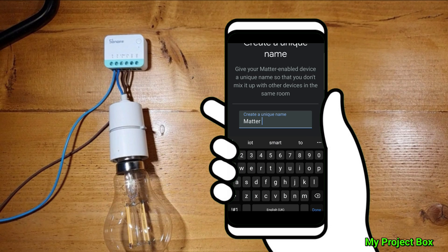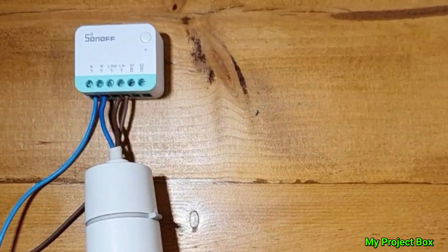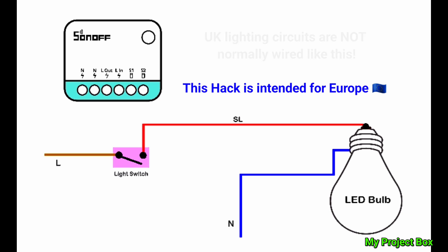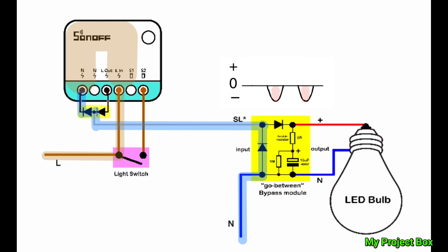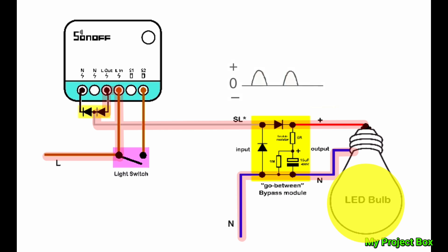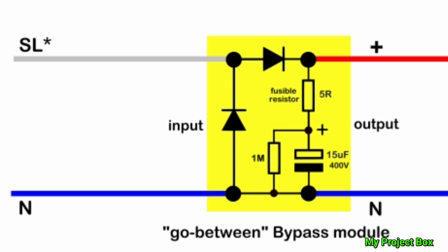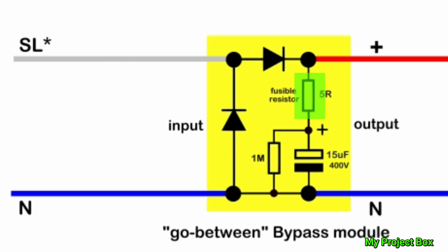Local control without any cloud service, and it works. Now this device requires a neutral connection to power itself, so wiring it to a lighting circuit with no neutral behind the switch is problematic. But if we connect up my special circuit hack, we can divert the neutral back from the light bulb to the Sonoff. This allows it to be powered normally, while still being able to turn the light bulb on and off. The switch line now does double duty — it supplies both the neutral to power the Sonoff and the live supply to power the LED bulb simultaneously.